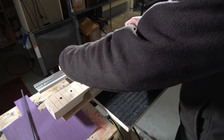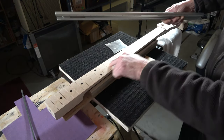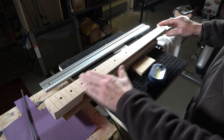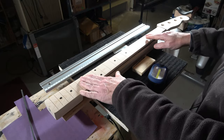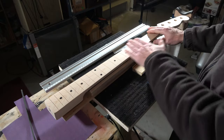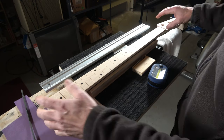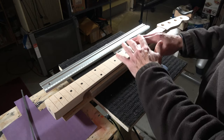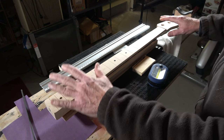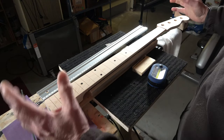What I'm trying to achieve is having the entire length of my precision straight edge in contact with the fretboard. Some of you will probably think the way to fix this is to adjust the truss rod to induce back bow, which would counter the bow occurring in the center of the fretboard. However, that's not the right way to do it — later on when the guitar is finished and strung up, string tension is going to induce even more bow, requiring even more truss rod adjustment, which can crack the fretboard or damage the truss rod. What we want is a relaxed truss rod with no force applied to the neck.